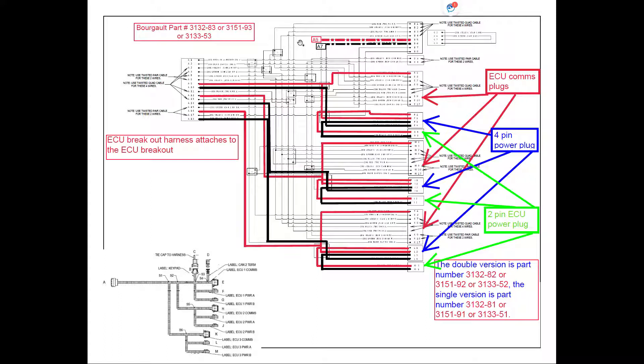Also in the harness for a 9000 series, they've changed the power for the switch box. Power now comes from pin A9 — not shown on this drawing but visible here — where A9 now goes to pin B5, and pin A7 now goes to B6. This gives us power to our scales and our switch box that isn't spliced off going to all the ECUs. This is coming directly from the ECU power relay on the main tractor harness.